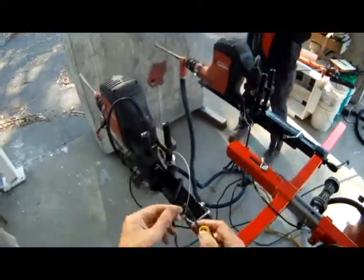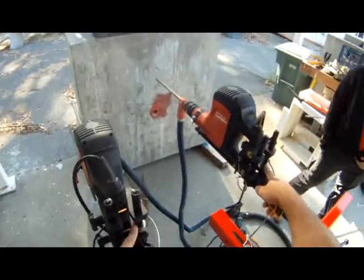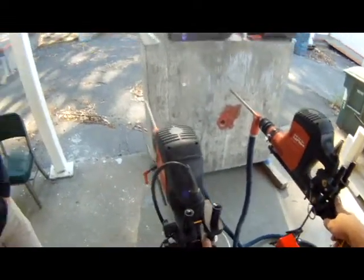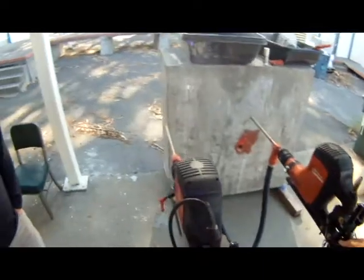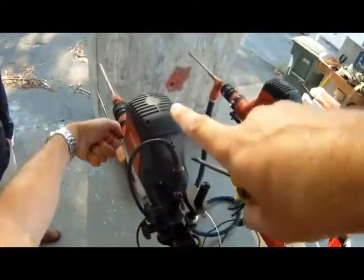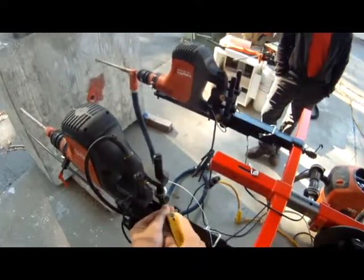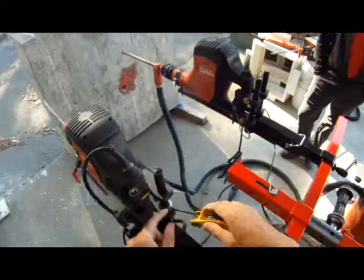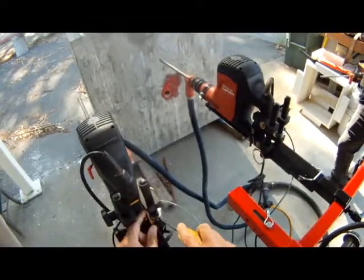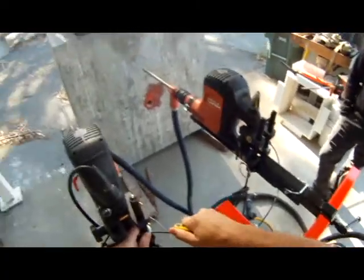I just noticed that we put these collars here because that's where the slip point would be in these polymers, because the load comes in like this, and if it was going to move, it would force it to go like this. Mm-hmm. So as long as we lock one of the back polymers, everything else will stay in place. Yeah. So that's what these retaining rings are for. I just put these in this weekend. That's why.